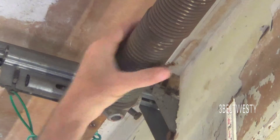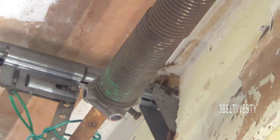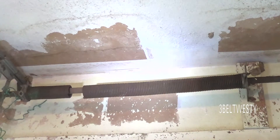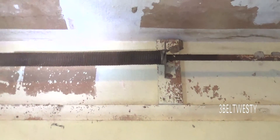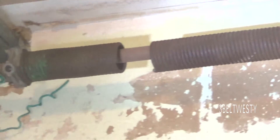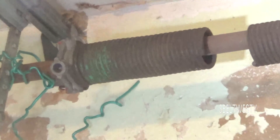I'm going to put this back over here and measure the whole length — that's a little over 30 inches. On this right-wind spring, the right side is fixed, and the left side is the part that goes to the rotating shaft that hooks up and lifts the door. So the tensioned part is on the left, and the fixed part is on the right.